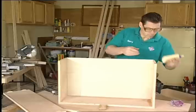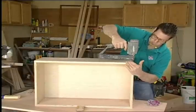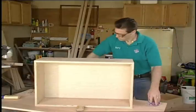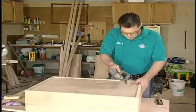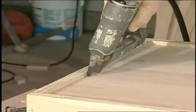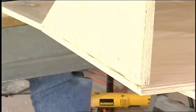Dry fit the drawer before using any glue. Assemble the sides with glue, making sure the biscuits get saturated. Use inch-and-three-quarter staples at the joints as well, rather than using only clamps — they provide enough strength so that you can flip the drawer over and nail the bottom in place immediately. Be careful to angle the gun enough to ensure the nails go into the plywood sides. Use the same procedure for the angle drawer.